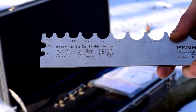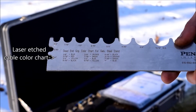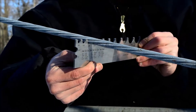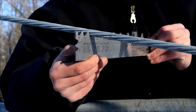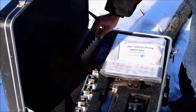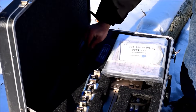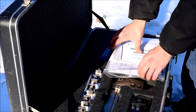We'll be using a Pentec laser etched cable gauge with cable color code, which comes optional with purchase of the tension meter. Just fit the gauge slot on the cable until you get a snug fit without any wiggle room. The cable gauge slots work from most ¼ inch to 1 inch galvanized steel strand and bridge strand cables.